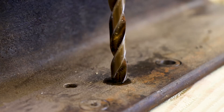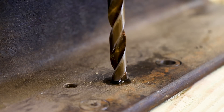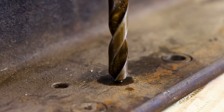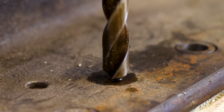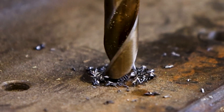Because of the rotation of the drill bit it could walk — that's what walking means. Depending on which direction you're leaning, it might walk to the left, but generally it would walk to the right. These split point bits eliminate that. The best way to drill through metal is to use low speed, high torque.